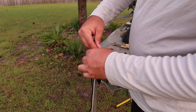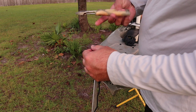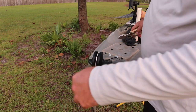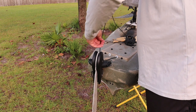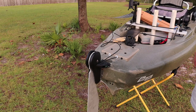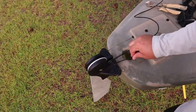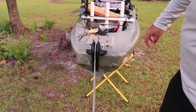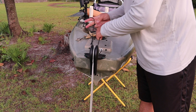Now you're going to take this up here like this and you have to twist it around this time. You need it to be as smooth as possible. Then you're going to take your cutters and cut it flush as possible. Now you'll be able to pull that through underneath there — easier. We'll get these cables reset how we want. Remember, we're in the down position so we should be in the down position up here, which will tighten that cable up. It's going to be a little bit loose — not a big deal, we're going to adjust that here in a second. Get this pulled through here like so.